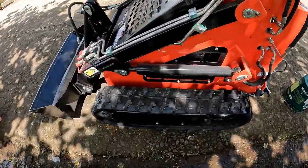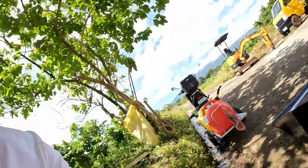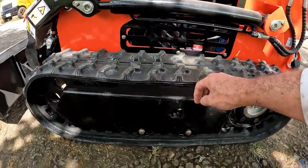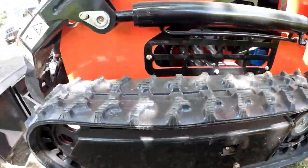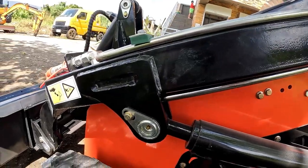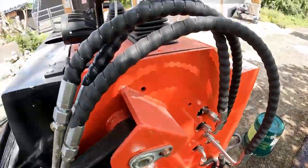My primary motivation for buying this was to do landscaping with the bucket. I went ahead and got rubber tracks for this one and I see a lot of improvements from what I've seen on the excavator. If you remember, on the excavator the track adjusters were hard to get to — they changed that to a female zerk fitting right here, so it's going to be very simple to make your track adjustments.